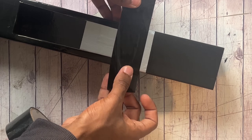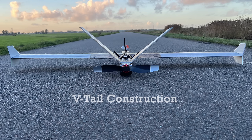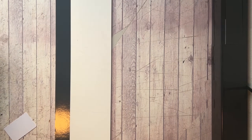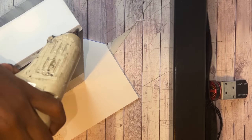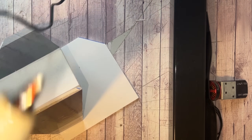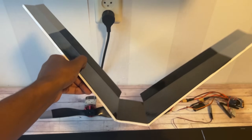After merging the two fuselages together, it's time to reinforce and clean up the front section with the hatch and tape. Here are the dimensions on a 5mm thick foam board sheet for the V-tail. If you want clear and specific instructions on how to build a V-tail, I've put a video on the top right corner for you to check out. Here you see me taping the outside and inside of the V-tail, finishing the control surfaces, and then applying the shape by gluing a small-diameter foam board strip inside the cut and using a template to maintain the 90-degree shape. After the glue has hardened, I'm left with a complete V-tail ready to be glued on the fuselage.